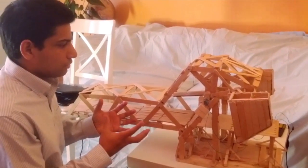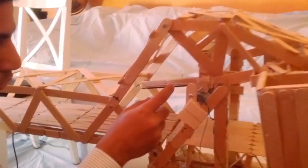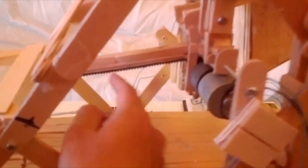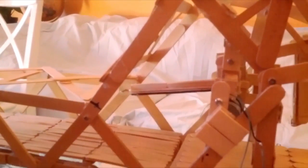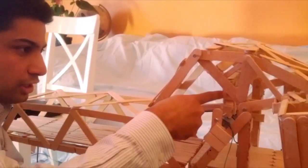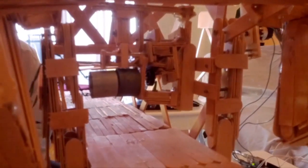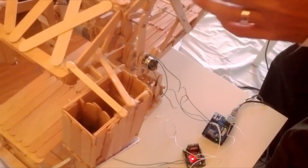The most difficult part to construct this bridge was the strut frame, and the difficulty was to make the pinion of the motor align and mesh with the rack. I actually made the rack using a pulley belt and just glued it on a piece of wood. In order to mesh the rack and the pinion properly, I had to design the strut frame with oblong holes on X and Y axis so I can adjust them using screws and nuts so I can get the precise alignment. So the motor I used to move the bridge was a DC motor with a gearbox in front of it.